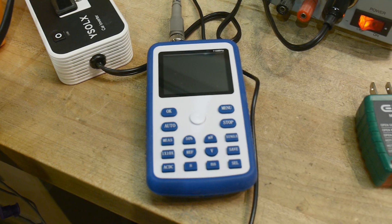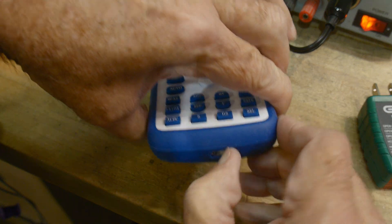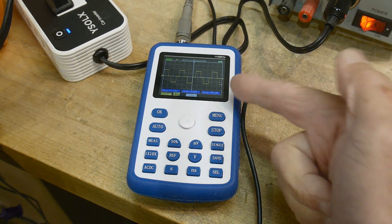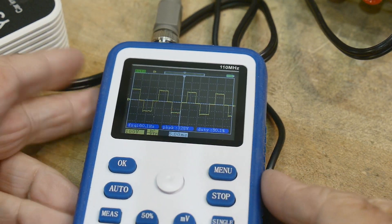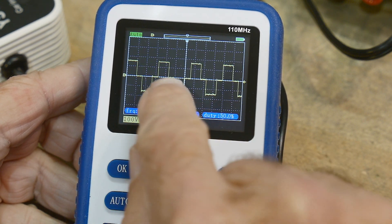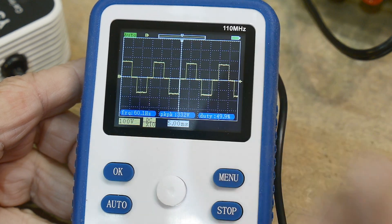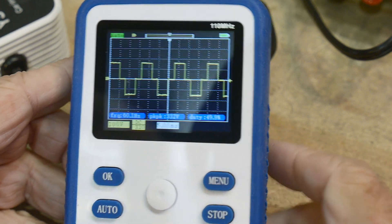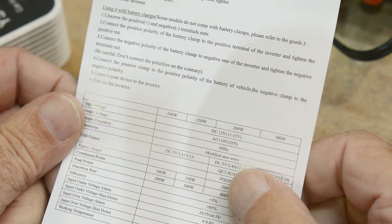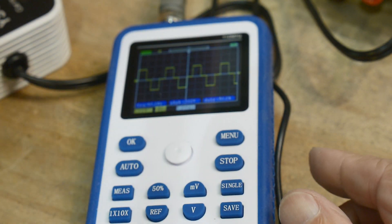The unit is DC-isolated, so it's somewhat safer, but still be aware the ground pin does nothing for you. Now let's look at the oscilloscope — it's completely isolated. Turning it on, there is the waveform output. It is not a sine wave. It has a dead period, goes high, another dead period, then goes low — essentially ones and zeros in AC voltage terms, plus one then minus one with some stalling in the middle.